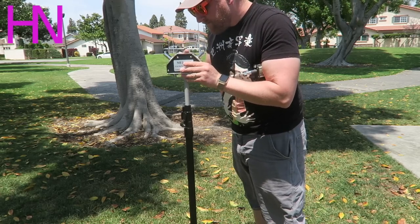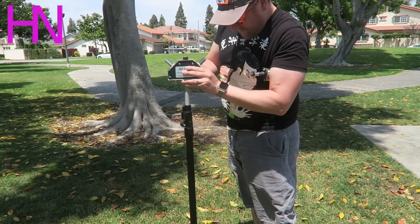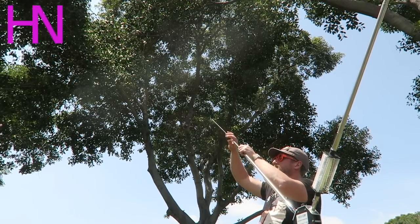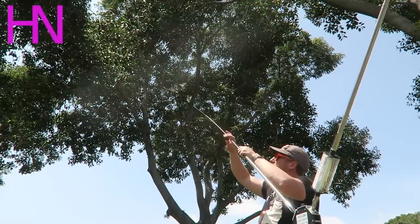After that, just take the fiberglass poles, run them down the tripod — they're very firm, very sturdy — and then attach the center connector with the two leads, the 45-degree angle leads, and then your lead for your coax. There are a couple of ways to use the aerials and the center connector. If you just use the telescopic aerials alone with the 45-degree connector, you're only going to be able to get up to 20 meters. If you want to add the 40-meter portion of the antenna, you're going to need to use the loading coil.